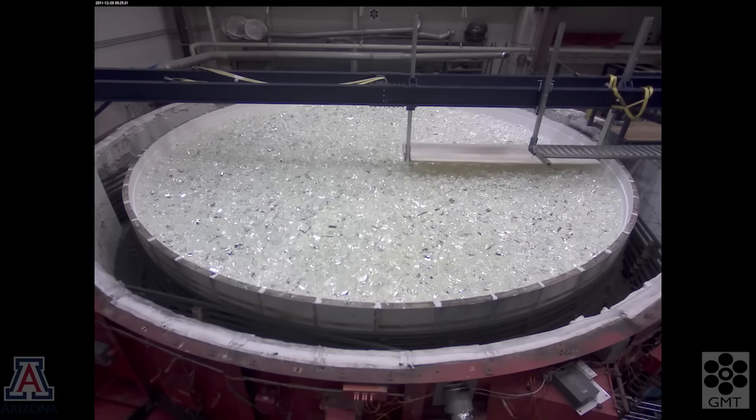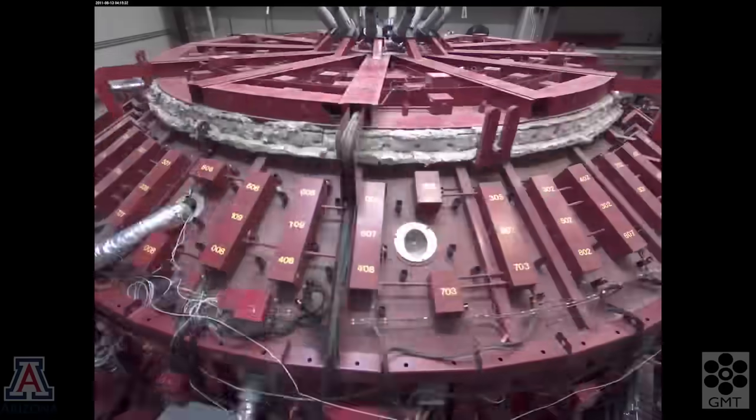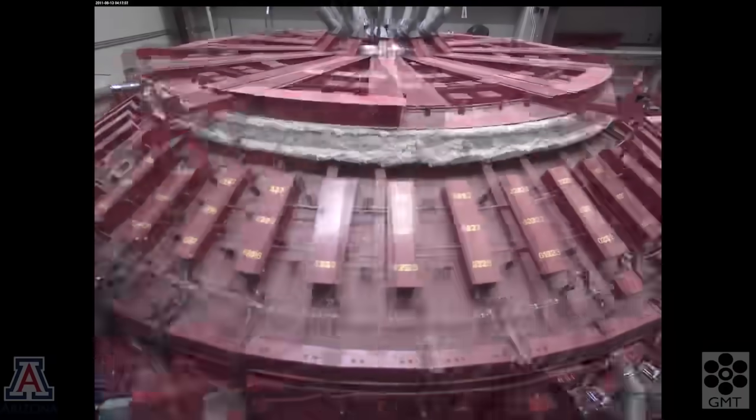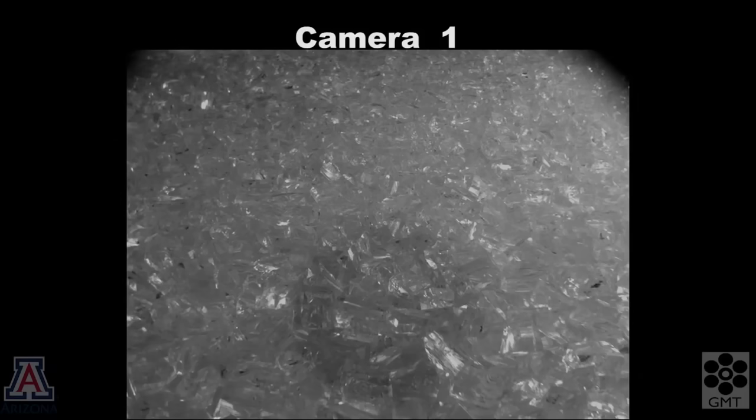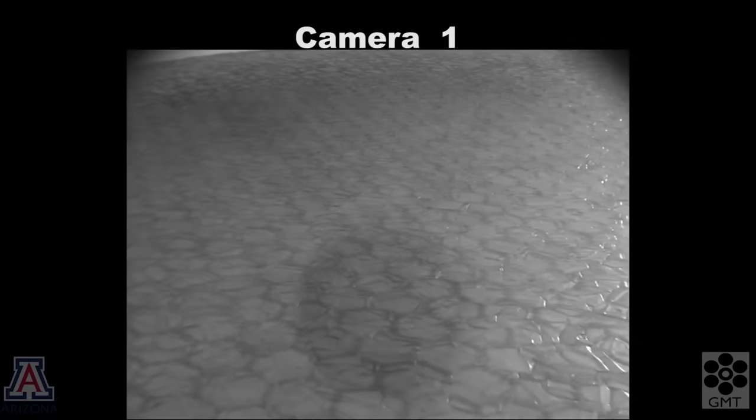Each block was broken out of a larger piece, so the surfaces are pristine and the blocks melt together without any trace of the original blocks. When the glass loading is complete, we reinstall the furnace and raise the temperature to about 1200 degrees C, spinning the furnace as the glass starts to melt. Now we'll change to a view from one of the cameras mounted in the ceiling of the furnace, so we can watch the glass melt.